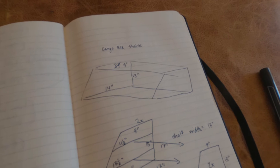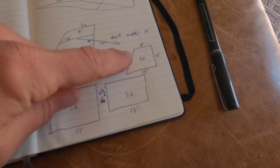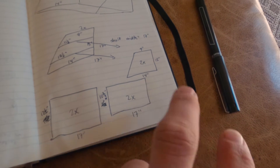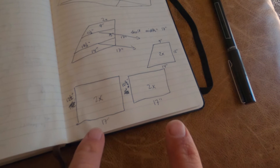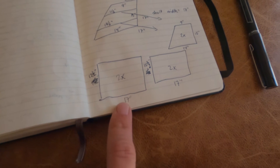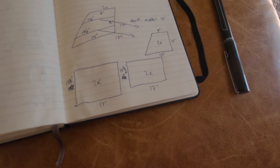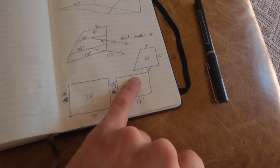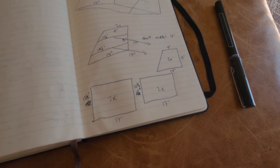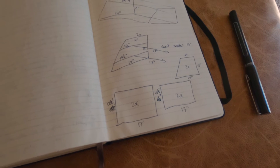Here's my rough sketch — super simple, just so you can make sense of it. I'll have two horizontal pieces with the 14 inch depth, 13 inch height, and 9 inch depth across the top. Then I will have one shelf that's 12 and a half inches by 17 inches, and one shelf that's 10 and three quarter inches by 17 inches width. I do need two of the vertical pieces. Super simple — hope that makes sense, and if it doesn't, once I put it together maybe it'll make more sense.